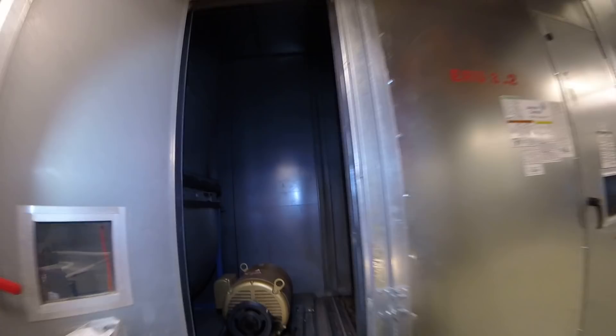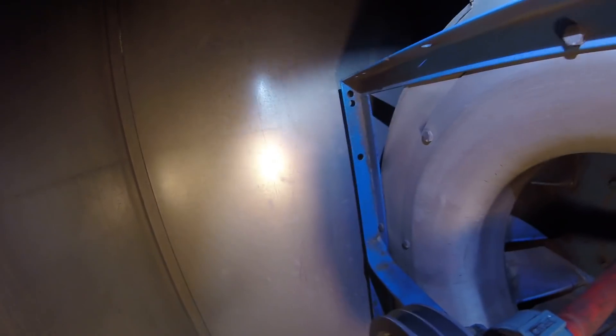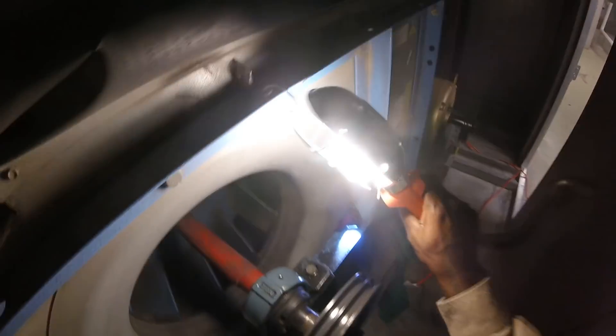When you're on the phone with the vendor or the bearing place, they're going to ask you a few questions on the specs, and they're going to need five things: the length, the width, the distance from the base to the center of the shaft or center of the bearing, the center-to-center distance of the bolts, and the shaft size.